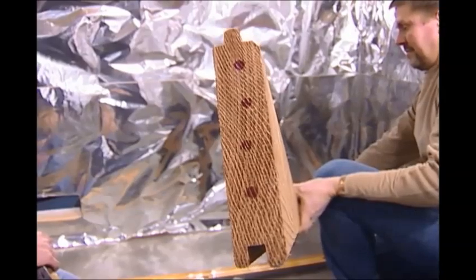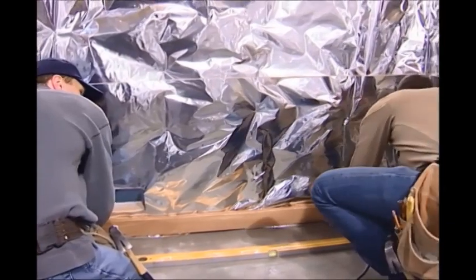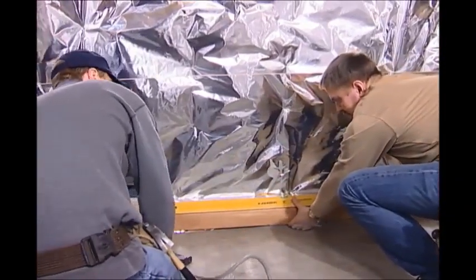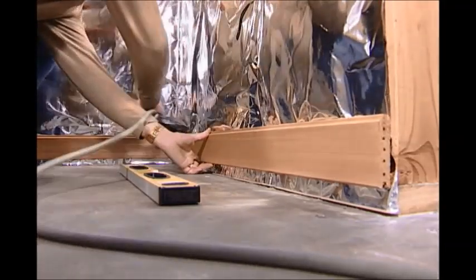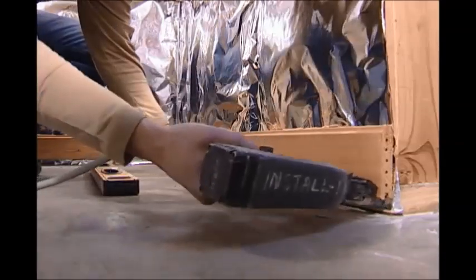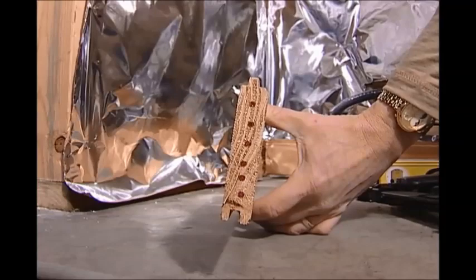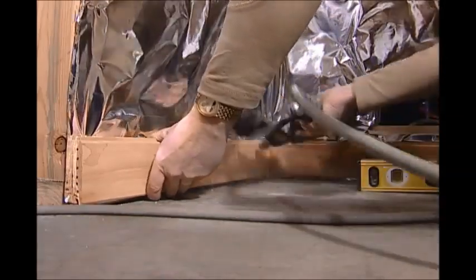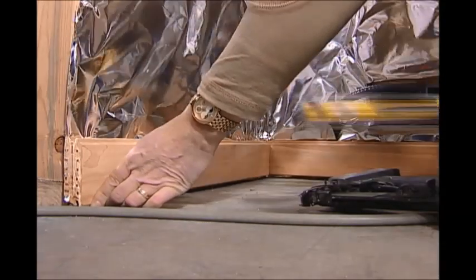Find the first left wall board, which has four dots, and place it against the left wall. Put the right end of the left wall board to the back wall board, then line up the boards and nail the end of the board. Level the board and nail it to the studs. Find the first front right wall board, which has five dots, and butt it to the right wall board. Toe nail the ends, making a tight fit to the wall. Take the first front left wall board, which has six dots, and butt it to the left wall board. Line up the boards, nail at the corner, level it, and nail in place.